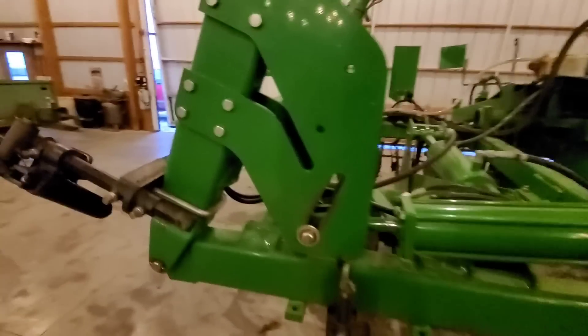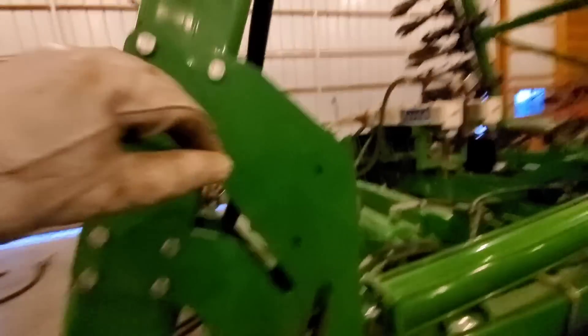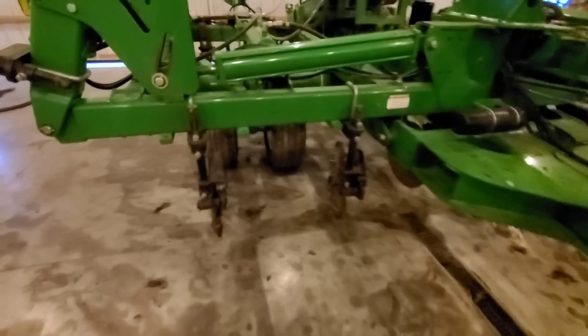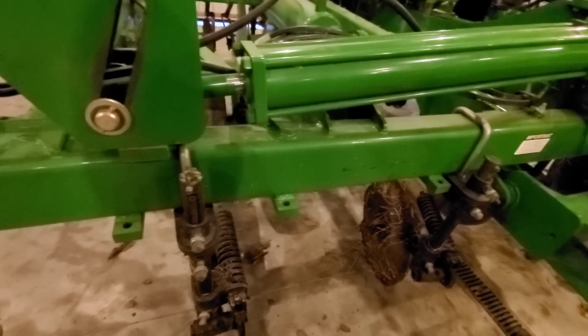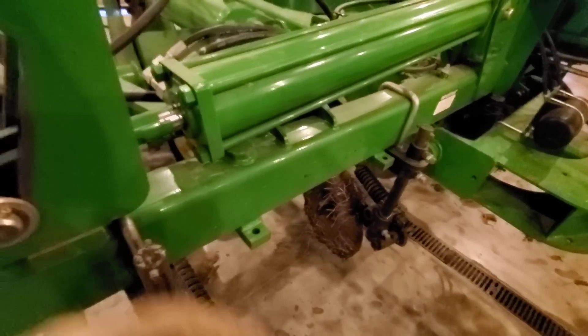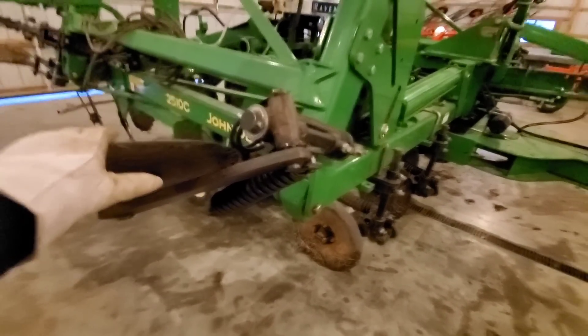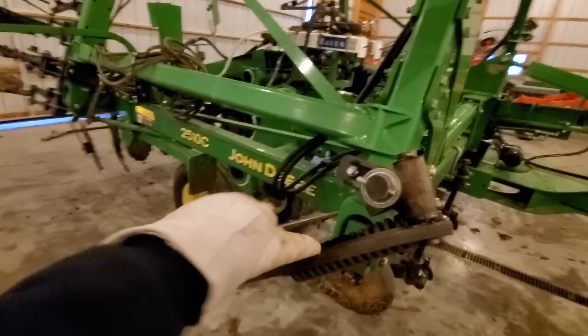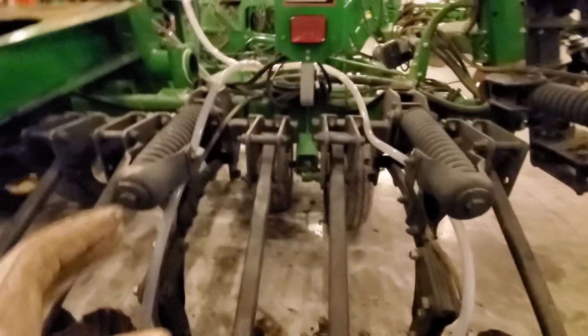On a 12 and 13, the knives would be in between — there's a slot for the U-bolt to go through, and the outer units are dropped down. On the Master series the coulters are on 15-inch centers, around 22 or 24 inch, and they attach via a hydraulic rocker shaft. The C's and S 2510 S Mediums used the 22-inch free-swinging coulters. The S Masters have a rocker shaft closer; the C's and S Mediums use the free-swinging one.